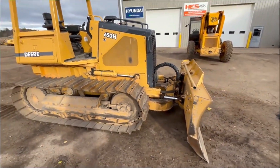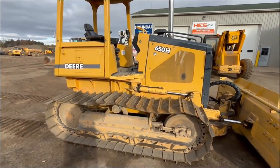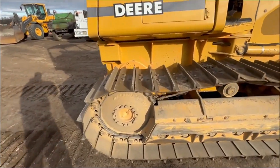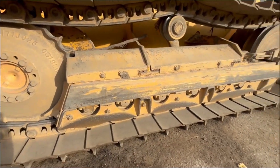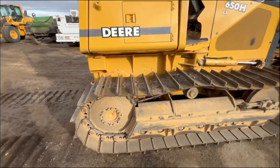Pretty minimal blow-by blades, good and tight. Bottom is like new. Sprockets are getting a little thinner, but this is a replacement bottom. Idler carrier rollers, all your rollers in the bottom are good — maybe some sprockets in the near future.